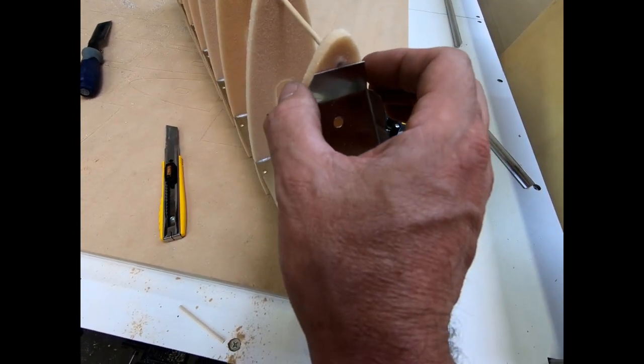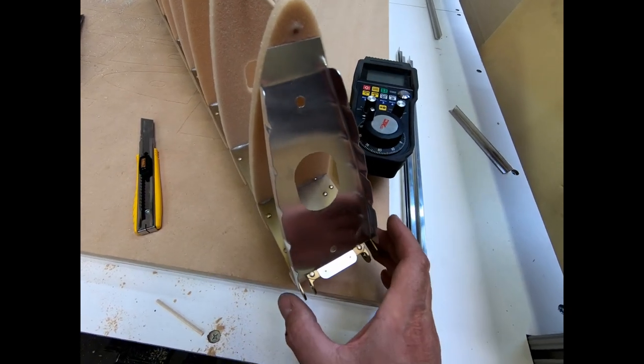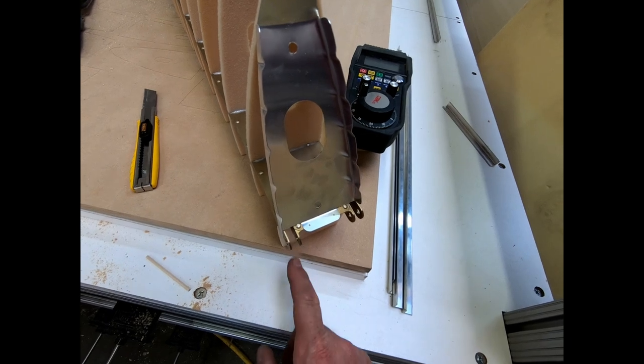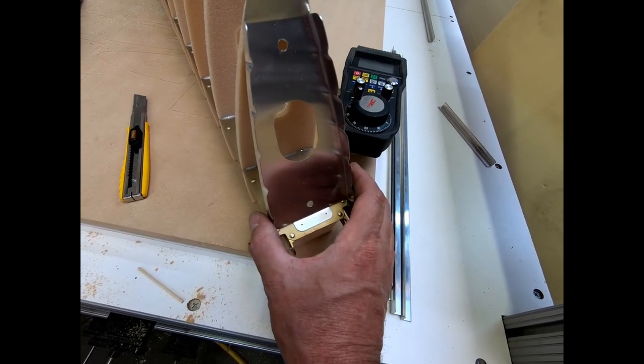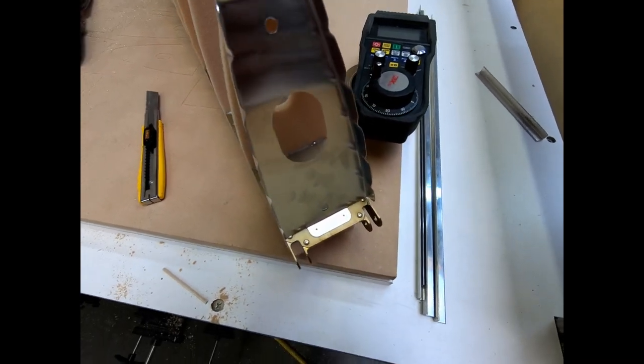And then we've got to position this on the nose, which I believe gets glued into place. And then the aft rib basically goes from here out. We got to bend the same or similar angles on the other side here too. But I'm going to try and get these positioned and get these installed and clecoed into place on top here.